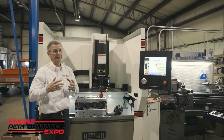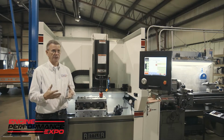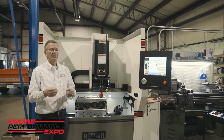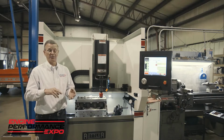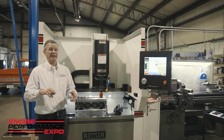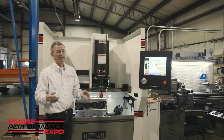Probably some of the most critical things to this is your base finish. You have to determine what grit diamonds you want to start with, be it an 80 grit or a 140 grit or a 180 grit or a 270 grit, 325 grit, whatever it may be. You have to figure out where to start. And the way to do that is to look at the surface finish parameters that your ring manufacturers are asking for. And specifically, you want to look at the RVK value.